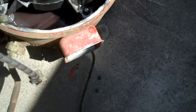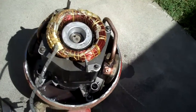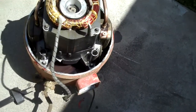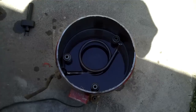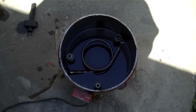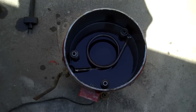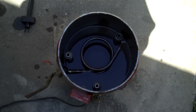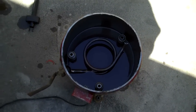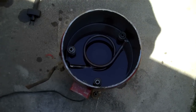Let's see how it sits in a bunch of oil down at the bottom. This is the bottom of the compressor with the compressor and the motor pulled out. Then you have the tube in the bottom that's coiled. That's actually a steel tube — steel tubing stuck in the oil. That's the discharge tubing. So it heats the oil, boils off some of the refrigerant, and helps with migration.